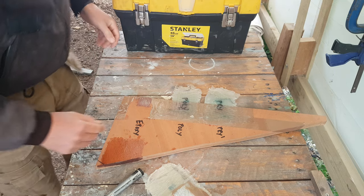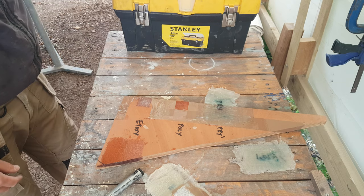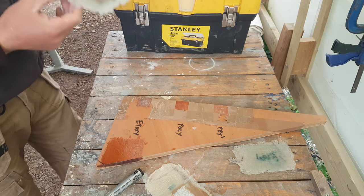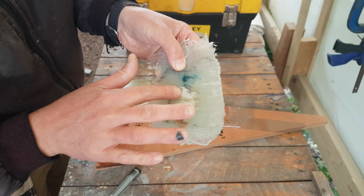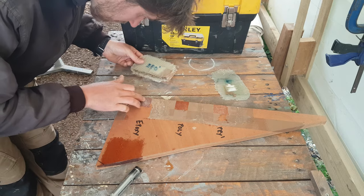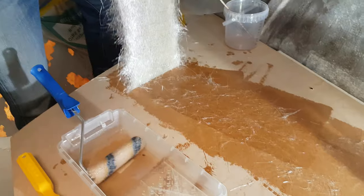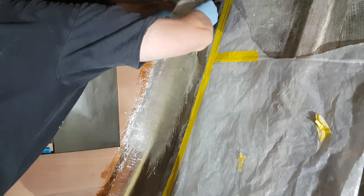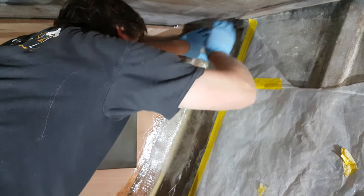Polyester on its own next — a two. This came off incredibly easily. Primax had a bit of fight; I think that was a good six. Both the epoxy and the Primax left cloth on the plywood and broke in the layup, implying that the bond was stronger than the actual materials. So this experiment gave me the confidence to go ahead and use standard polyester resin combined with Primax to glass in the new forward bulkhead in Black Sheep.